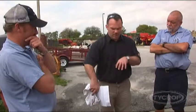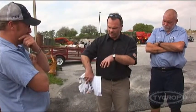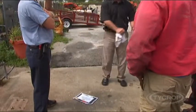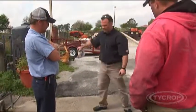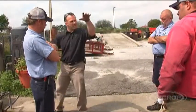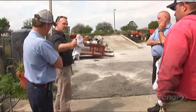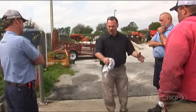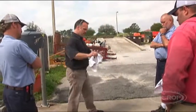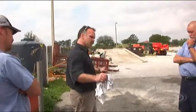As the disc is moving and spinning around, I can drop the sand on the back of the disc or the front of the disc. Here's home plate — imagine the ball falling straight down on home plate. If I stand behind home plate and swing the bat, I'm going to pull it. If I stand in front and swing the bat, I'm going to push it. So we're moving the disc relative to the hole where the sand falls. If the pattern is heavy in the middle, we slide the disc backwards so the sand throws heavy to the outside to overcompensate. Depending on whether the middle five feet is heavy or light, you slide it one way or the other, and that'll clean up the spread pattern.